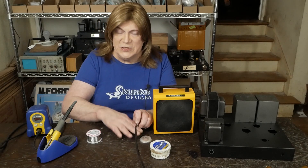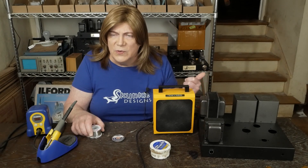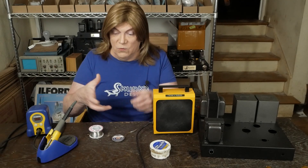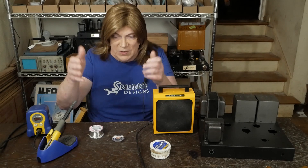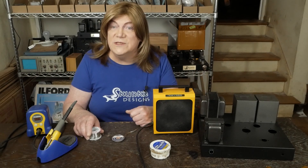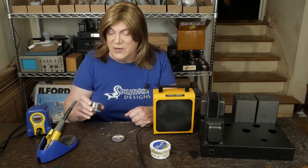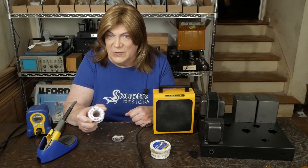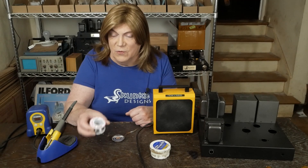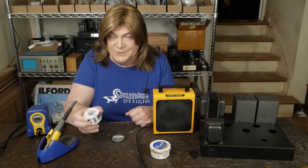People don't know what kind of solder to use that works well for hobbyists, so I thought I'd go over that and put a link in the description. I tried some Alpha 3743 no-clean solder, and even with years of soldering experience I couldn't make it work — it just wouldn't flow into the joint. I've got a pound of it sitting here; if somebody wants it, send me an email and pay shipping. I've been using MG Chemicals 6040 RA solder, which is the old-school rosin core stuff and it works great. For point-to-point wiring I use the .050-inch, and for circuit boards the .032.